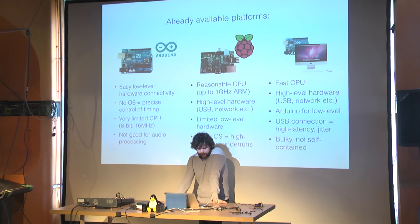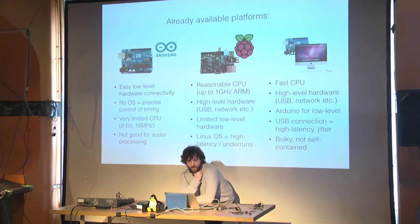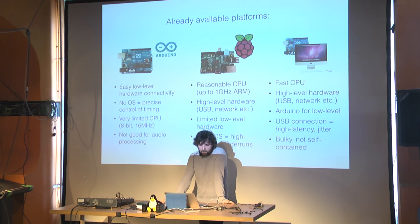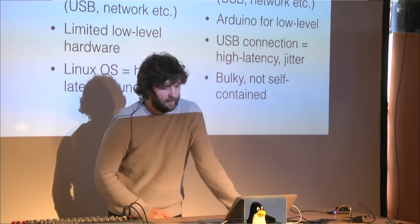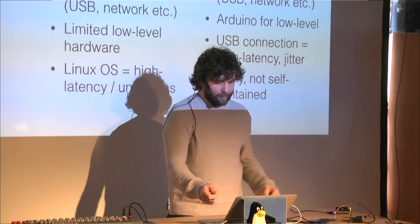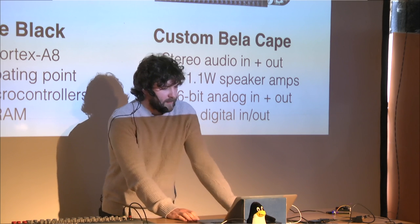On the Pi you can do pretty similar I/O stuff — digital GPIOs, analog ins — but it's an embedded platform so you need a custom environment to make it work properly. I tried running Raspberry Pi with a USB dongle as audio in/out and was getting around 50 milliseconds latency with PD, which wasn't really useful for playing music. Of course you could use your laptop, but you'd lose low-level connectivity. This platform packages everything into a convenient package built on top of a BeagleBone Black with a custom Cape.